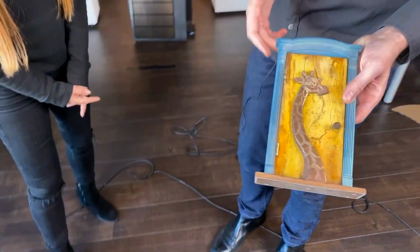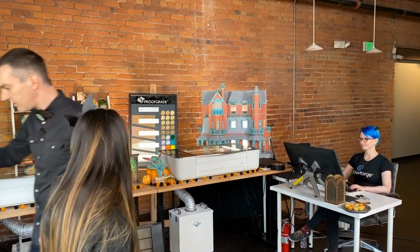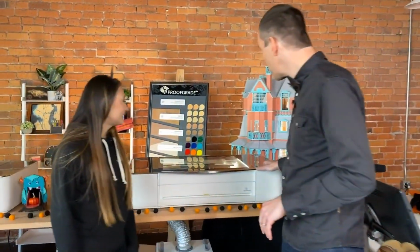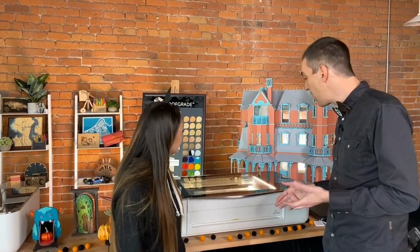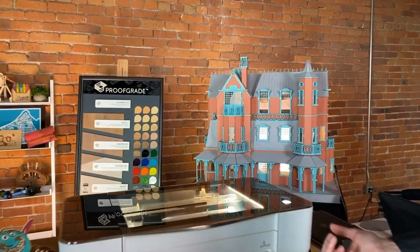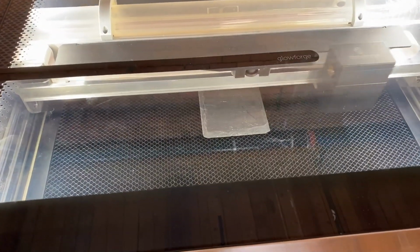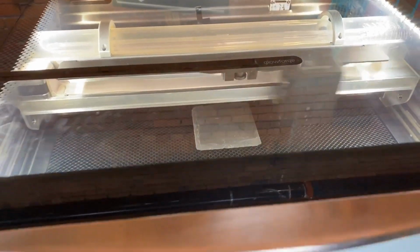Let's see, we've got our slate coaster loading. Yeah, we're ready to start printing on some bats. We're about to get batty. All right, let's push the button. This is going to show you something I don't think we showed before in this live stream, which is engraving. When it engraves, it actually moves back and forth. You can see how fast this is moving, taking advantage of that high top speed. It's going left to right, and it's pulsing up to thousands of times a second to give an incredibly precise, high-resolution image that's going to engrave on this solid stone.